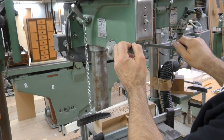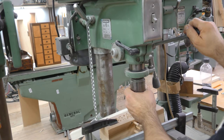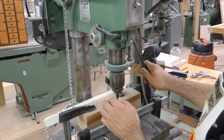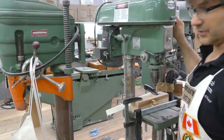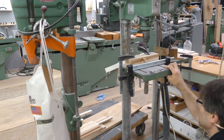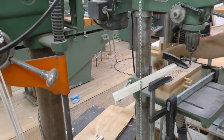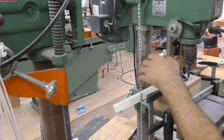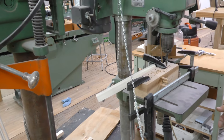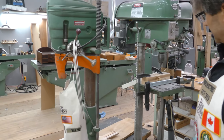This drill press has a quill lock — you squeeze this piece and hold the quill in position. There's another adjustment here to get rid of as much slop as you possibly can. What I dislike about some of the newer machines is that with the quill fully extended you can wiggle it quite a bit, and that runout makes for inaccuracy when you're drilling. The downside to this particular machine is it has a small work table — the table is adjustable and you can turn it 45 degrees in both directions, but there's no adjustment to wind the table up or down.